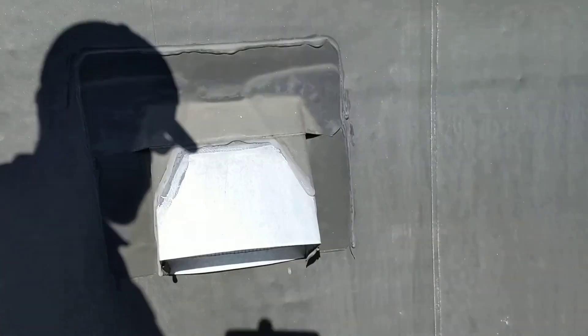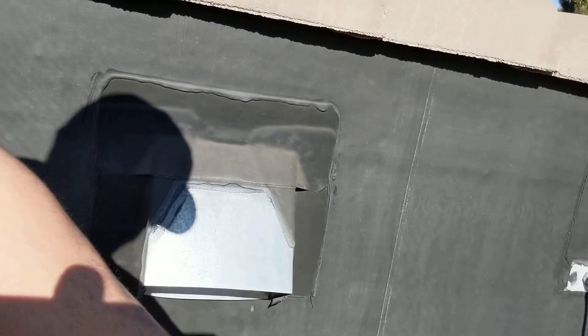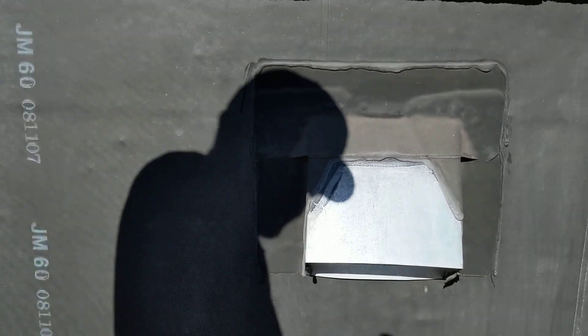So that's how you fix a leak when you can't pinpoint the exact spot. I know the leak is there — it's just got to be underneath the metal bracket, like maybe where the screws already penetrated the EPDM membrane, or possibly the metal bracket that goes around the drain just kind of wore through the membrane itself. I've sealed all the way around the metal brackets several inches out, so we don't miss wherever it's leaking from.